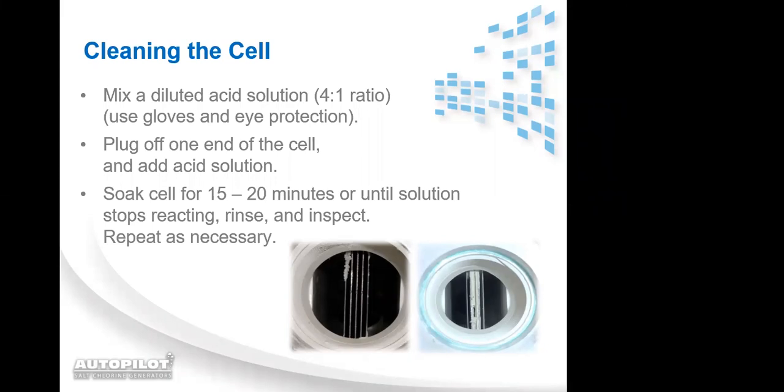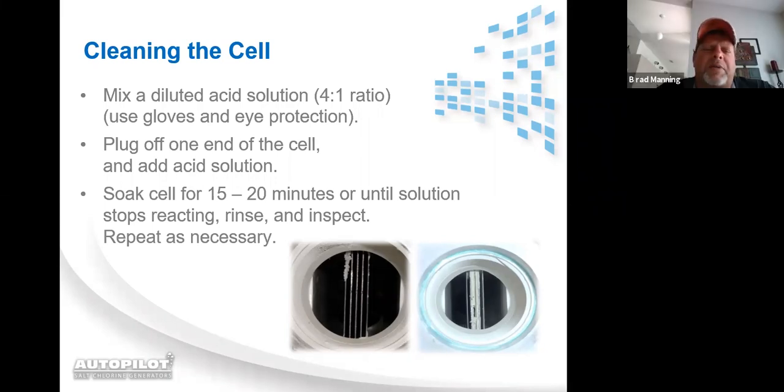Okay, thank you, Brad. Now, I see that they're mentioning something about having 2 autopilots on it. As I said, remember, any salt system, not just our salt system, has a byproduct of sodium hydroxide, which has a high pH of, like I said, 7.8 to 8.0. So as the salt system is generating chlorine, it's also generating the byproduct, which is raising the pH in the pool. pH is probably the number one thing that causes a pool to be scale forming. The higher the pH goes, the worse it gets.